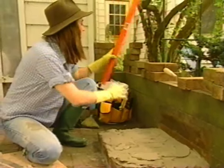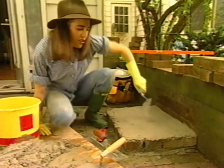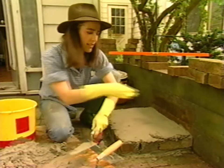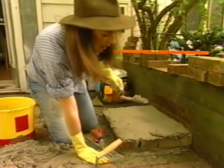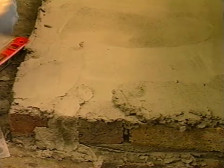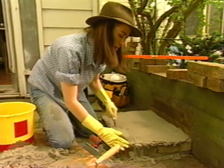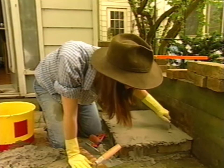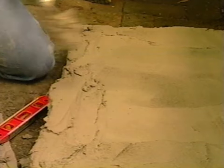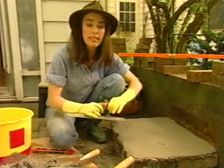That's better. If you're any good at all at icing cakes, you will excel at this — it's truly fun. Now the trick is around these edges where the mortar is kind of falling off: build up a bit of a ridge, and when we put the bricks on, press that excess out. I'm going to plug that spot now so I don't have to come along later and do what's called repointing — basically just filling in mortar where there's some missing. Often on chimneys, you get missing mortar that breaks out and you have to repoint.